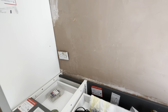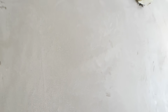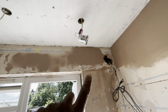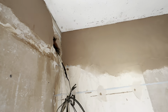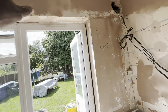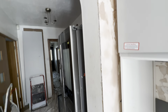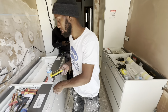Quick update — we've been very busy. We've done this wall; I ended up doing pretty much the whole thing because it's all going to be tiled with cabinets. I hit it with some plaster just to give the tiles something to grip, patching up areas where plaster had flaked off. All around here is going to be tiled, same thing up there. We've basically filled in any little area so it's all nice and flat. Now we're going to go for lunch and then come back to do the self-level and test the newly plastered areas again.